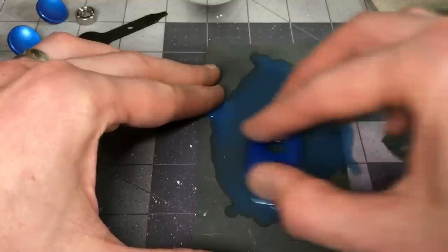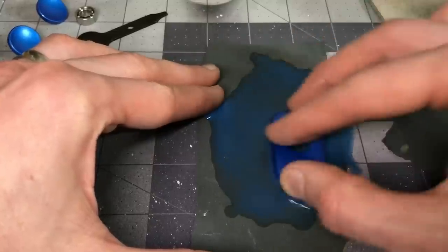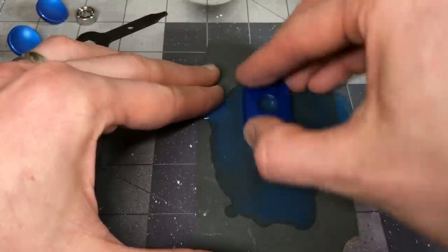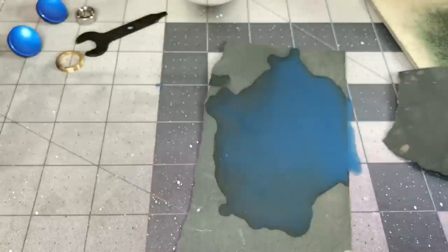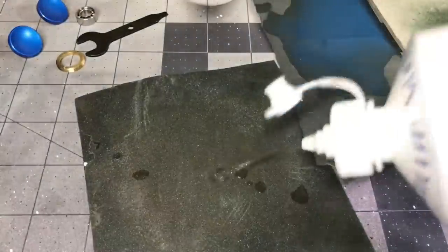I'm shaking the camera quite a bit. I'm just doing circles - you can certainly do straight up and down. In fact if you're not using anything too fine grit, you may want to just use up and down so you get a consistent pattern, consistent scratches. We're getting there, we still got a little ways to go. For the sake of not being here all day, let's go to 240 - this is pretty aggressive.